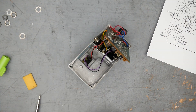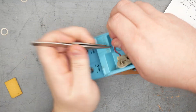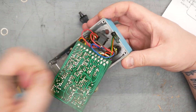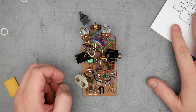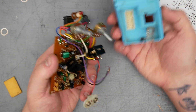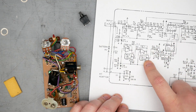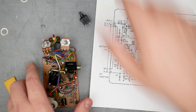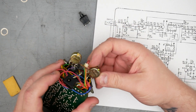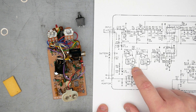I'm going to liberate the wires off the switch. So here's the circuit board separated from the enclosure. First off, let's just check the values of these pots because it seems like they weren't original - let's make sure they match up. On the left should be rate, on the right is depth. We can cross-reference that to our schematic. Depth is 100K linear and rate is 100K linear.